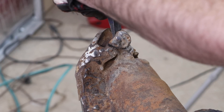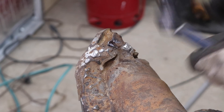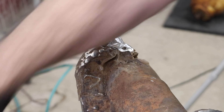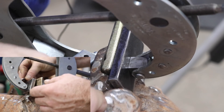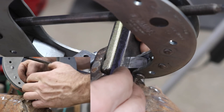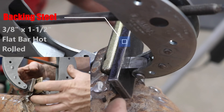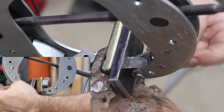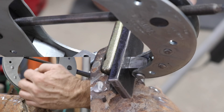I'm going to cut it off — cut this out. Here's a big chunk that I cut away and a couple little pieces. I got a piece of 3/8 by inch-and-a-half flat bar and kind of fit it on there. I want to leave some material underneath here, at least something to weld to, so that's why this is at an angle. We'll weld this in here along the bottom. Then I'm going to take a torch and heat all this end here and manipulate and forge that over to back up the tooth.